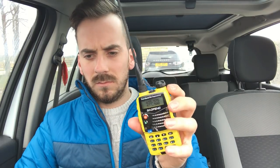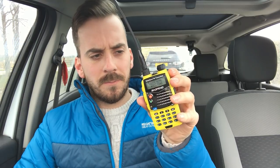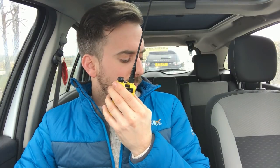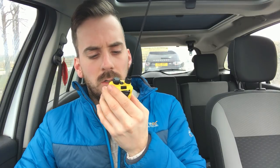Okay, what does this sound like? I'm on the Baofeng UV5R now. You said the audio is not as good but it was up one S-point — in what way is it not good? Well, the signal's the same, it's just fluctuating exactly the same as the other. It's still good audio, just a little bit more muffled compared to the Zastone. Interestingly, the receive on the Yaesu copy is actually better than on the UV5R, which is unusual. It could be the receive sensitivity or the antenna — not sure.